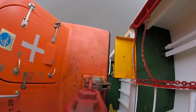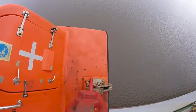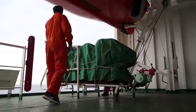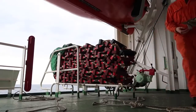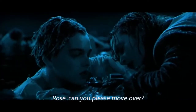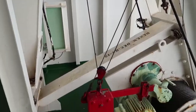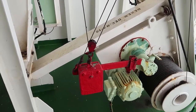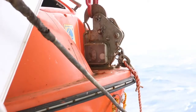From the outside, you can just lift up the brake governor and the cradle will swing out. If the seas are calm, you should release an embarkation ladder and climb down. Only in emergency situations should you ever jump into the water directly, because it's quite dangerous — you have to worry about debris, hypothermia, and swimming in rough seas. To lower from the inside, you can just pull the remote wire connected to the brake governor. Either way, once the boat is in or near the water, activate the hydrostatic hook release and you're good to go.